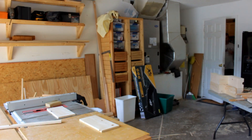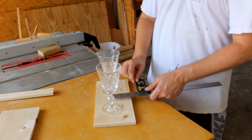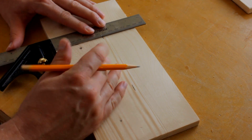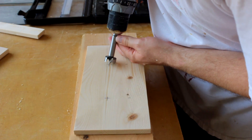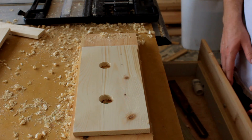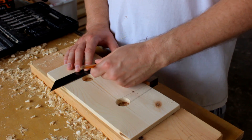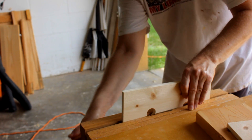Let's mark out for the wine glasses. My wife doesn't know I took these out to my shop — she'd probably shoot me if she did, but I really don't see a way she could find out. I'm smarter than the average husband. This is either a 5/8 inch or maybe a 3/4 inch Forstner bit — I forget which, but either one would probably work. I want to mark a slight angle for the cut out line, so I'll use my angle finder to keep everything symmetrical.